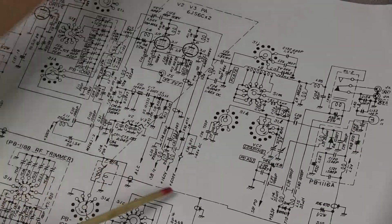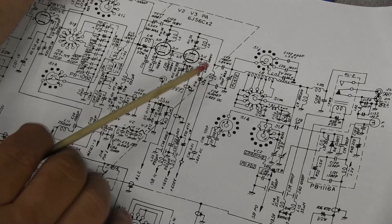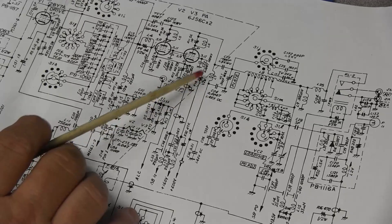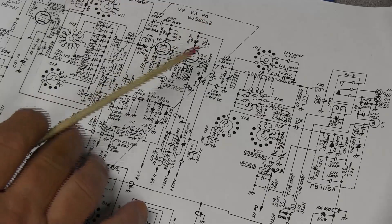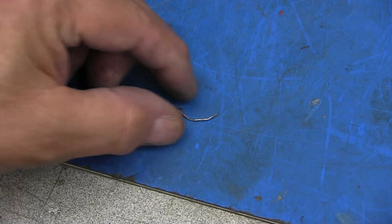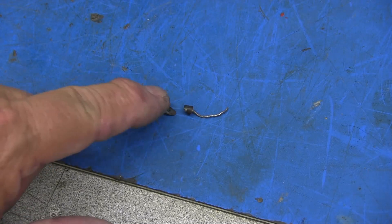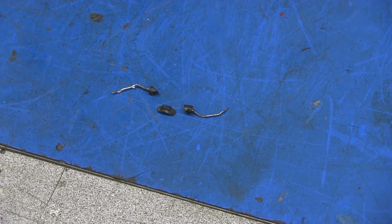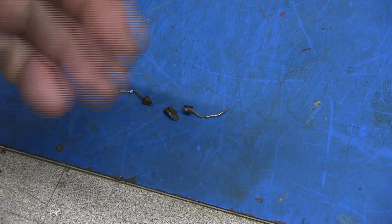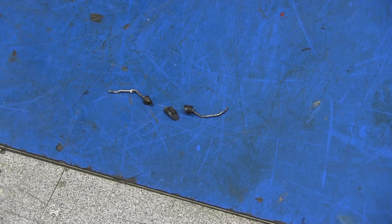Yep, that was it. You can see where the 160 volts comes up and that 100 ohm resistor right there was the culprit — that's what caused the problem, not getting any bias current and being unable to tune the transmitter. That's what's left of that 100 ohm bias resistor, and you can see it was completely broken — the other side was gone, I haven't found it. This side was at the top and I could see a little crack in the end of it, but I couldn't see the other side. When I went to desolder it, it just fell right in two.